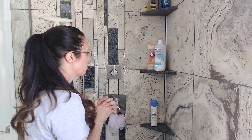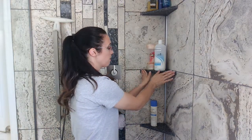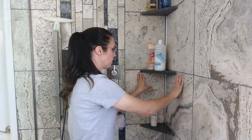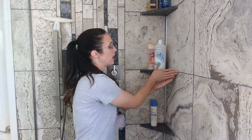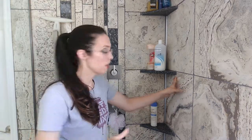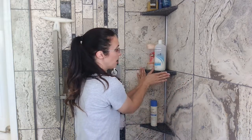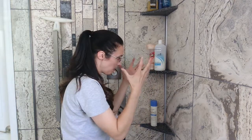When it comes to the actual install, last time we talked about extending the shelf into the wall to get more support from the surrounding tiles. I did that, and I felt I increased that by actually angling the cut on this tile as well. I've actually cut these two outside tiles at an angle, so this has a bit more strength — in my engineer head, that was a way to make the shelf stronger.